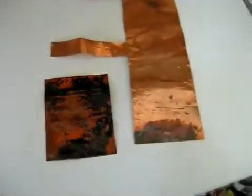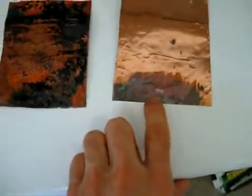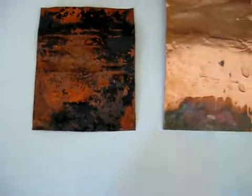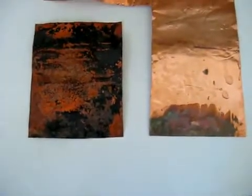I just took the solar cell apart. I noticed that at the bottom here of my copper electrode there's this area that looks like it's got a buildup of some corrosion or something from the salt. It started out gradually. It was clear like this originally. So there are some losses due to that. And I can see a little bit of it right here as well. So the longer you have it sitting in the salty water, the less performance you'll get.